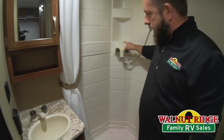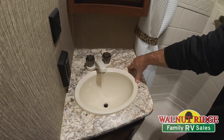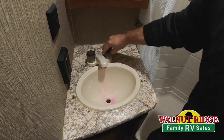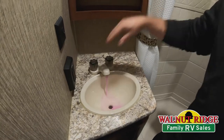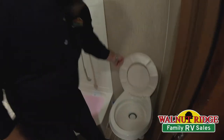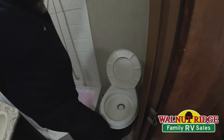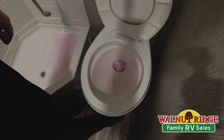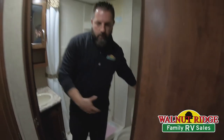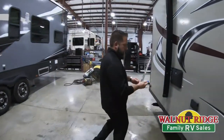You also want to make sure you have just a little bit in the actual faucet up here, so run that too. Now we'll go ahead and do the sink. Cold side won't take as long now because we've already run antifreeze into this room — there we go. Hot side shouldn't take as long either. Make sure you run enough to fill up the p-trap. Then don't forget your toilet — this is a big one; we replace a lot of valves on toilets. This one is a foot flush, so we just run the antifreeze through. You can see the pink coming in there. We have plenty of antifreeze in the valve. Leave that pink antifreeze sitting in the bottom of the toilet so it doesn't crack the bowl where water would normally be sitting.